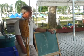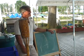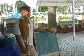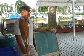John, when you're talking about the boom vang and bending the mast, isn't there a pivot point where the shrouds hit the mast? Like if you're driving the gooseneck forward, it's got to pivot off the shroud, so the top of the mast is actually going back.